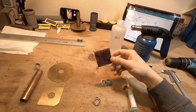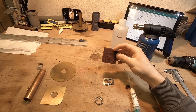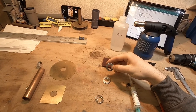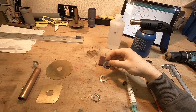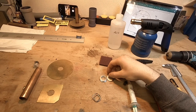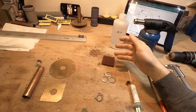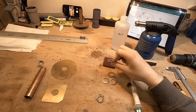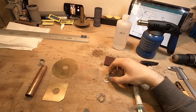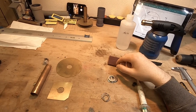We use some normal scotch bright, steel wool, or sanding paper. And some spacers — the things you put between a screw and a nut. These have three millimeters in height, and this is exactly the same height we need between the patch and the reflector.